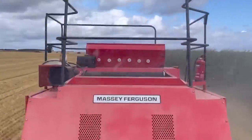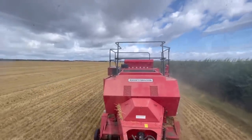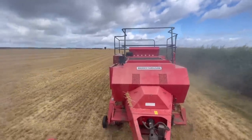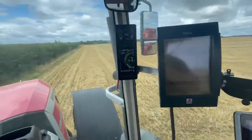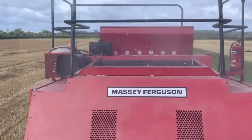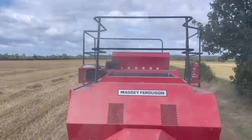You can see my little lollipops — they've just come up. Down they go. That means it's just knotted a bale. And it just tells me that obviously all the knotters are still working. If one of them stays up it means one of the knots hasn't knotted. It's quite dusty behind because that little silver thing there is the knotter blower, and that blue tube is where all the air comes from — it's blowing all the knotters to keep all the straw off them.